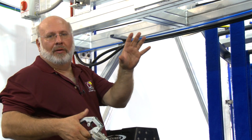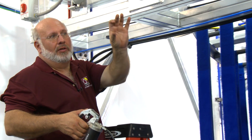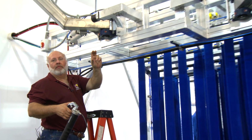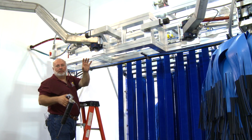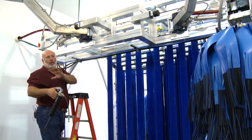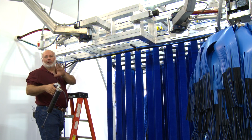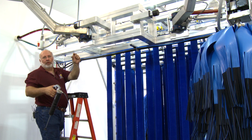These are electric wraparounds, so they don't have any rotational bearings on the arms, on the brush assemblies, because they work off of the bearings within the gearbox. If they were hydraulic units, they would have 2 rotational bearings, just like a top motor brush. So all of our top motor brushes are the same, electric or hydraulic. Some have bearings, some don't. If they're there, once a week greasing.